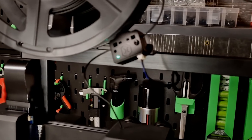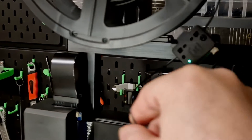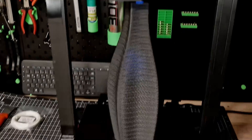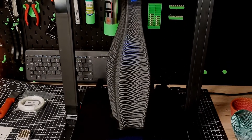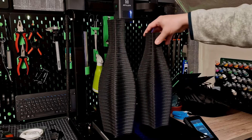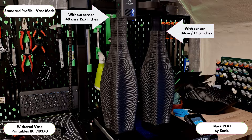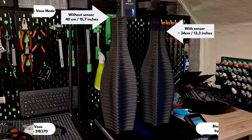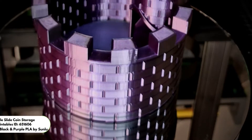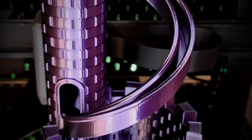One major drawback is that you can only use the entire printing volume if you remove the filament sensor. I had the problem with the sensor mounted that at a certain height of about 34 cm the printer thought it had run out of filament and paused the print with a request to get new filament. The error cannot be corrected during the print — the bending of the filament is probably too much for the path above this height. Also a proprietary nozzle is used, which differs slightly from volcano nozzles. The volcano should fit if you cut the silicone sock to size, but unfortunately I cannot confirm this.